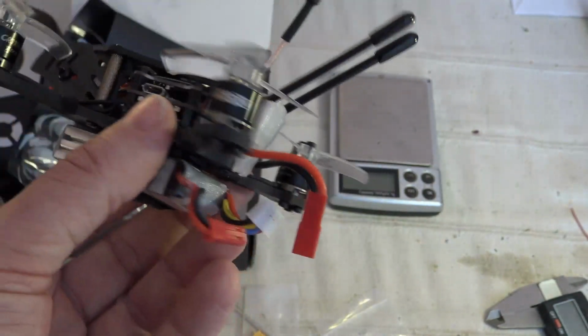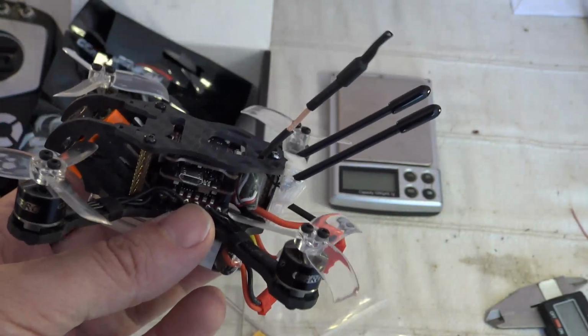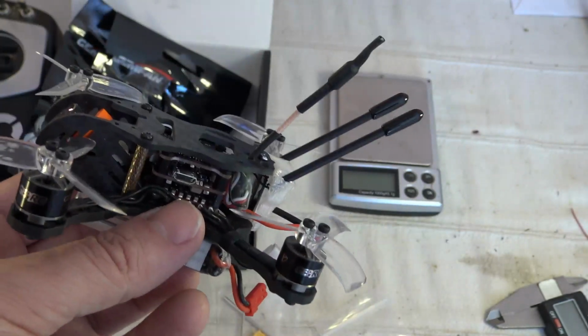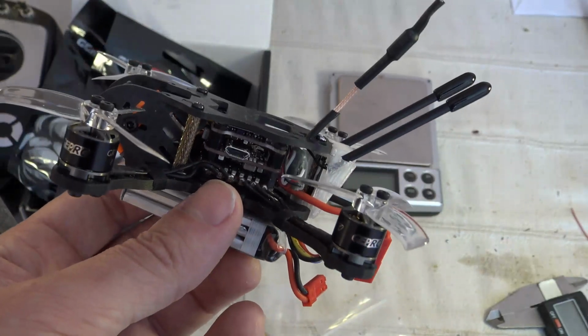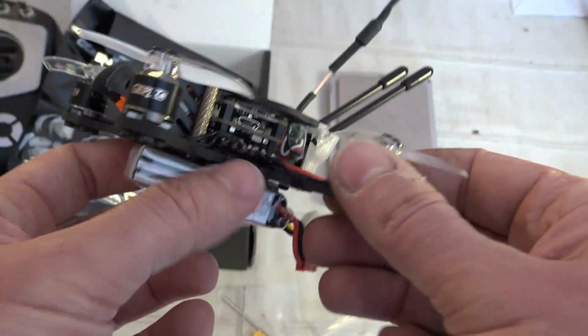What is good, it's possible to program everything from Betaflight commands. That's great. And for example, to turn on the pit mode option, minimizing the output video transmitter power until you arm this one, after which it will go to the original and nominal settings.